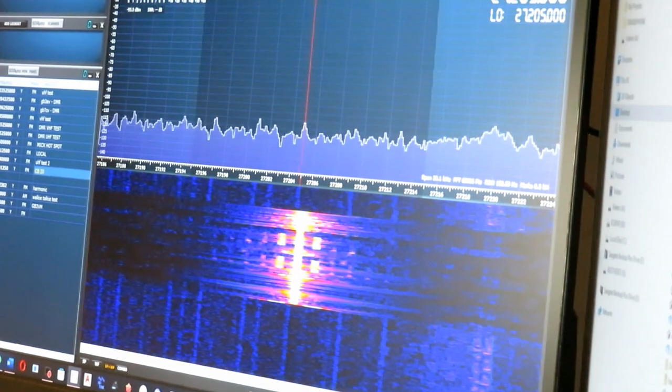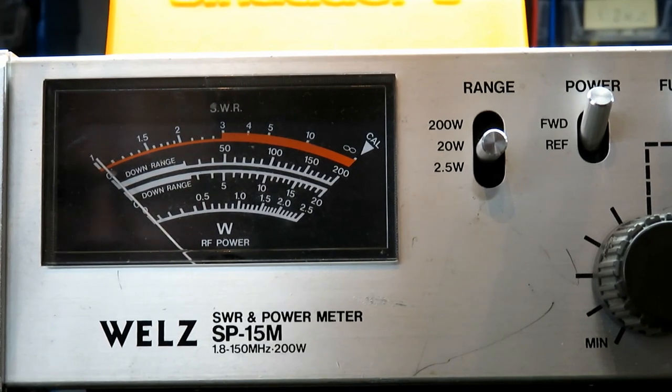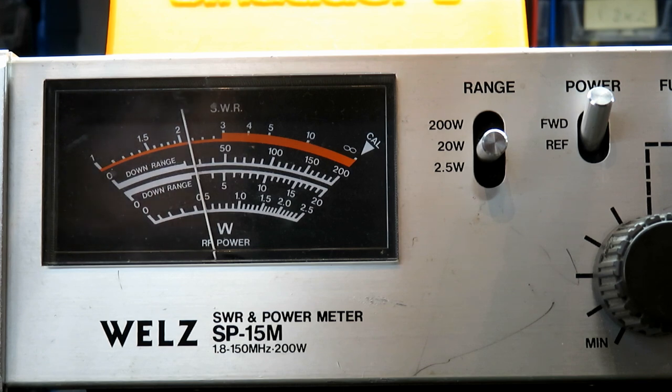Looking at the screen, I'd say that's looking fine, to be honest. All right, let's see if we can improve things on TX. There we go, into transmit. Let's drop in. That's going up. That's peak there. Move on to the next one down. Let's drop down. That's about there. That's peaked. So no advancement on the TX side, unfortunately.